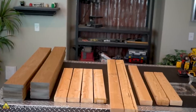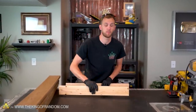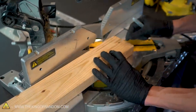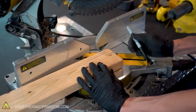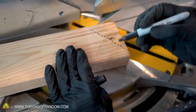With all of our pieces cut, we now need to start getting ready to assemble. The first pieces we're going to need are 5 of the composite boards and our two 28-inch 2x4s. These two 28-inch pieces will work as supports for the 5 slats that are the very top of the table. To avoid cutting and scraping knees while sitting down at the table, we want to modify the 2 side supports by cutting some 45-degree angles into the ends of them. After adding the cuts, our 2 supports will end up almost trapezoid shaped. We're going to have our cut end with about a third to a quarter of an inch remaining at the bottom for a little bit of strength.